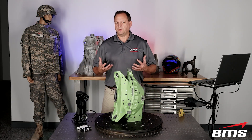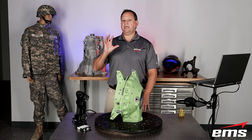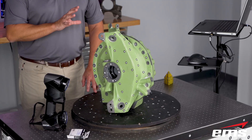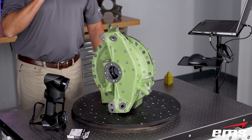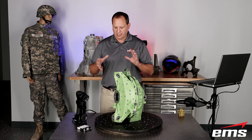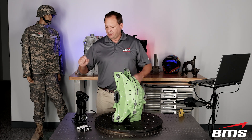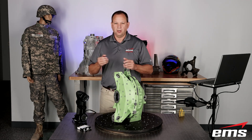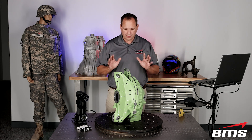So how are we going to do this? The key thing here is targets. You can see we've already applied the targets on this part. We've got the rotary table with targets on it. Now any scanner that uses targets probably can do this — in this case we're using the Creaform HandyScan Black, but the GoScan, even the Peel scanner, any scanner that uses targets technically could do this.